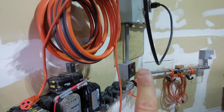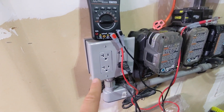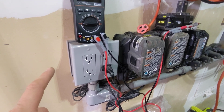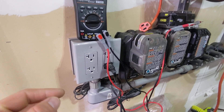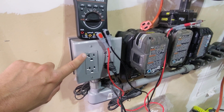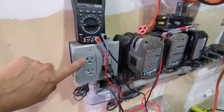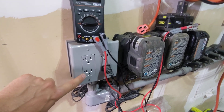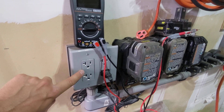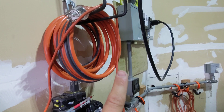The way you can get around this is on your AC300 you can change the grid power amperage from 15 amps down to a lower value. You can set the first AC300 to 2 amps charging and the second AC300 to also 2 amps. Now you're only pulling 4 amps total, so you haven't exceeded the 15-amp breaker.